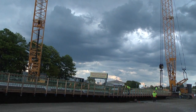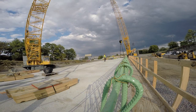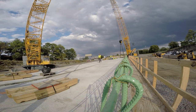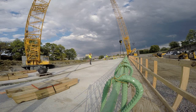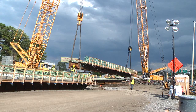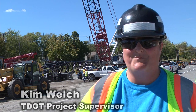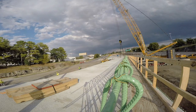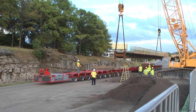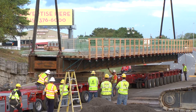On Saturday, TDOT contract crews had to move four panels divided into 16 pieces from the south work yard in the median of the interstate to the bridge site one and a half miles down the road. Watching the cranes lift some of these segments in tandem, it was a delicate operation. Each piece, weighing hundreds of thousands of pounds, was loaded onto a self-propelled modular transporter, or SPMT.